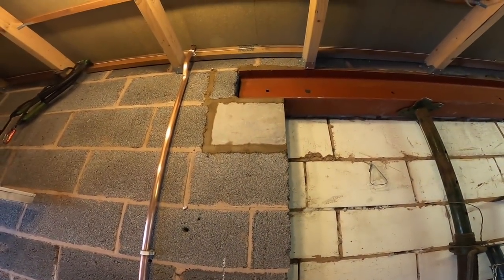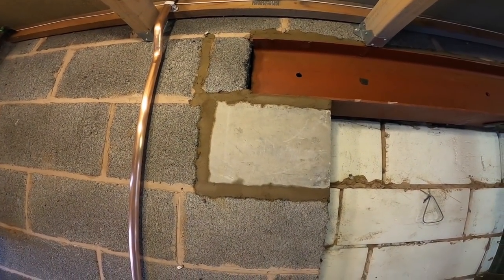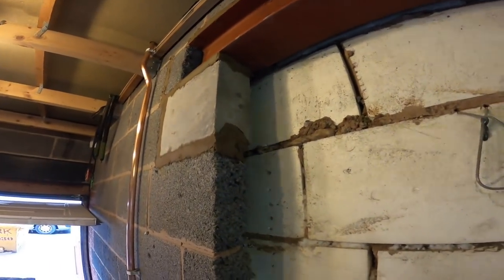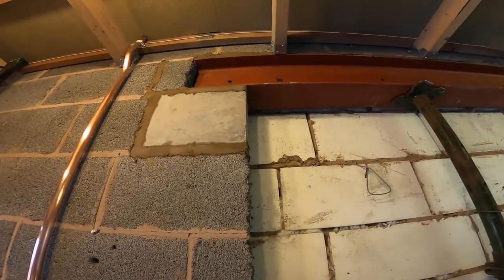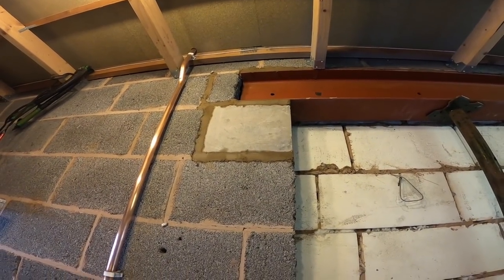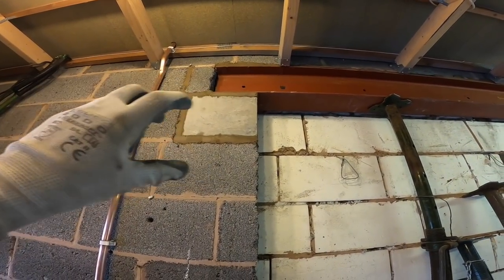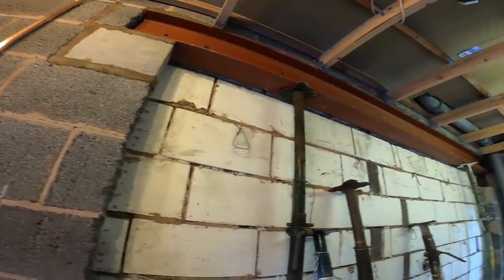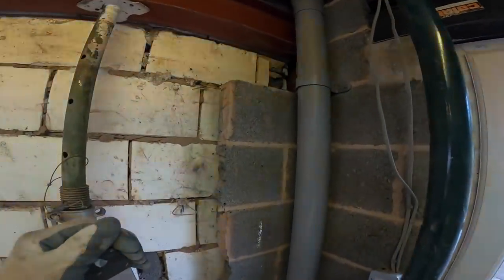That was supposed to be in time lapse, but I forgot to press record. So there you go, pad one in. And then we've got the ACROWS up overnight while that goes off. I never used to put a bed on top between steel and the PADSTONE, but I got a lot of comments about that. So we've got room here with this, so we've got a nice bed and then a bed above. So I'll time lapse this one a bit closer up.